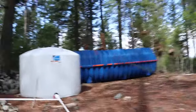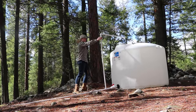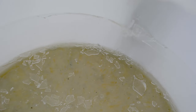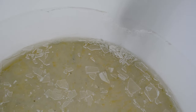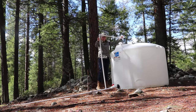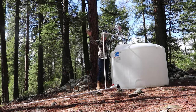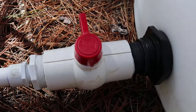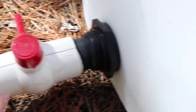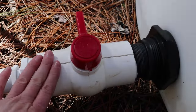Here she sits. So here is where our water goes into our tank. We actually did drain the system before winter, so I wouldn't be shocked if a lot of stuff isn't damaged. So far this part is looking pretty good, which is a really nice surprise. Here you can see this big two inch ball valve has cracked. These appear to be in good condition, so I think this is all we have to replace on this portion and I think this is going to cost us around 20 bucks.